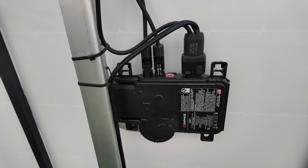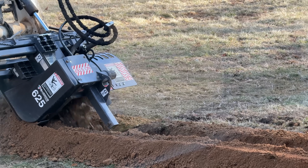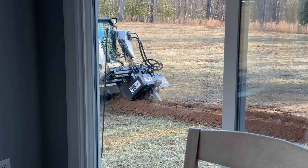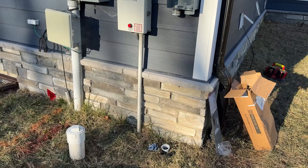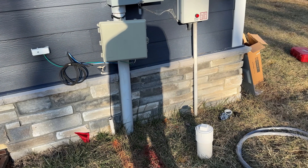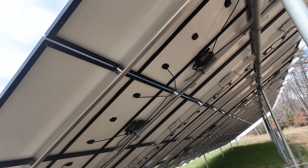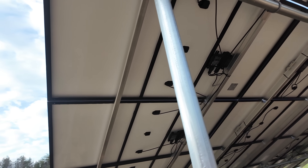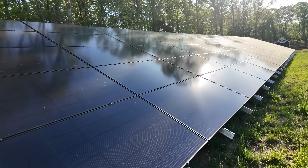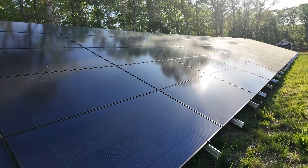So 80 panels, 430 watts each, with a slightly undersized microinverter on a ground mount array. We trenched about 300 feet from my service and ran 4-aught wire to send all this power through. There's a load center out here so I can pull power off and do whatever I want. Everything is nice, neat, and tidy with wire management up front. I'm going to DIY and get a lot more involved with the next solar arrays we put up out here.